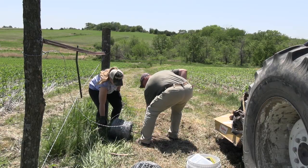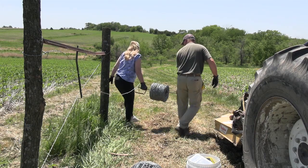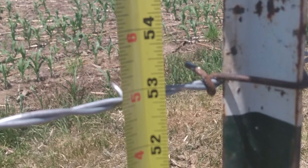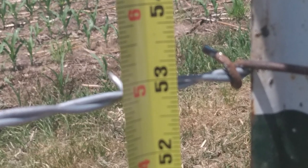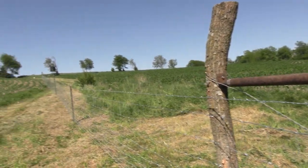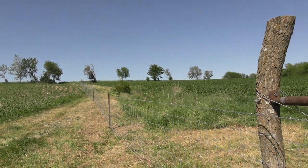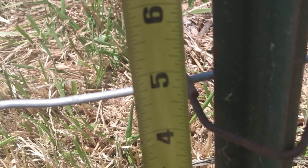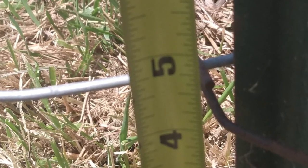The next step is to run one strand of barbed wire at about 53 to 54 inches up from the ground. You want it to be very taut — no sag at all between your fence posts and T-posts along the way. Then if you're going to buy woven wire, I recommend the 39-inch tall woven wire. Run that underneath the barbed wire and keep it about four or five inches off the ground, which gets you approximately 44 to 45 inches of height off that 39-inch fence.